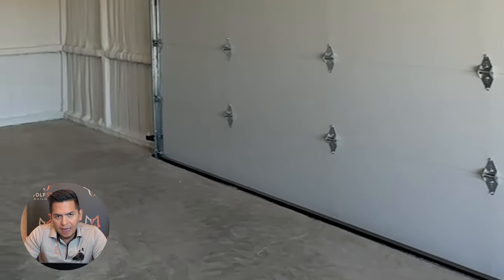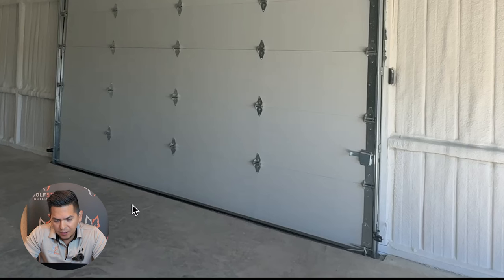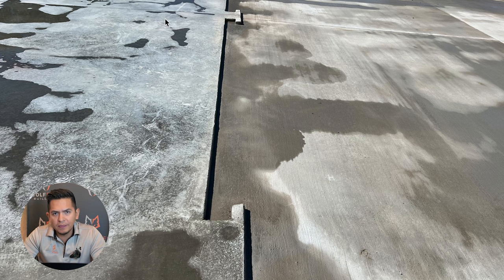Let me show you some pictures and go into detail. Here we've got a building that we did — you can see there's no lighting at the bottom of the door. If it was sitting up top, you would see some lighting. You can see down here we've got the notch detail around, the door sitting nice. This is really how it looks before a building is sitting on it. You can see here we've got some of what we call eyebrows — ceja — that's where the base rail will sit and the upright will go up from there, and the door tracks will sit at the bottom side.